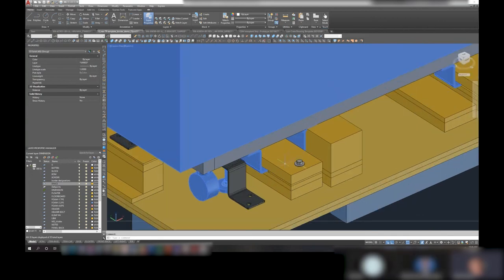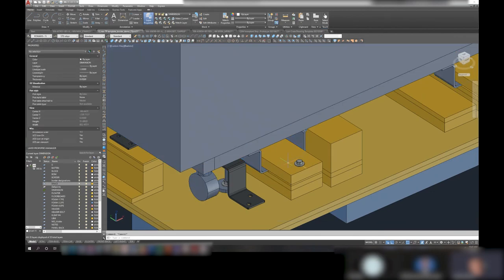When you use lag screw, I think this one will normally apply in Penang. In Penang, we pack a few machines, so all are using the lag bolt concept. When you use lag bolt, don't use one piece only. This one is the bolt, then below we put a nut. If you use lag bolt, you need to apply two, diagonally or maybe parallel. Normally, I will put diagonally.